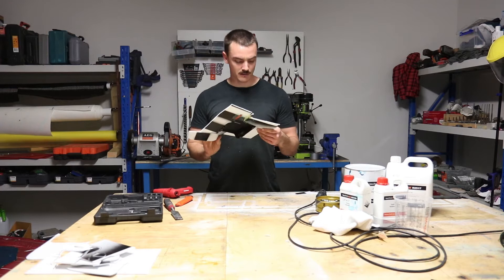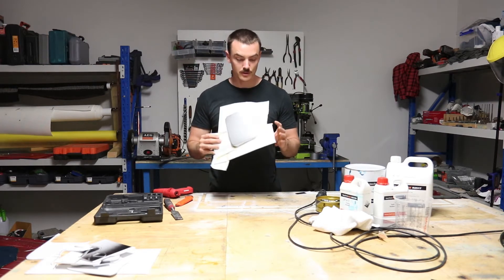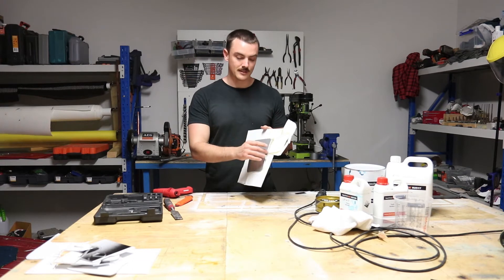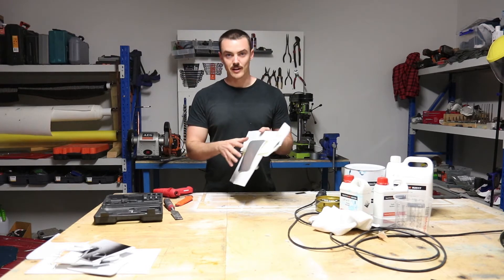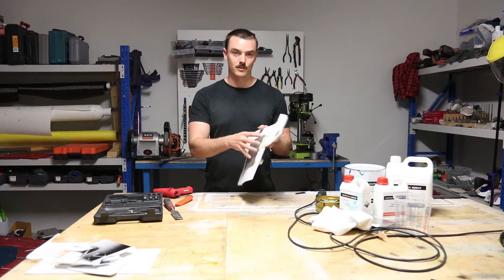Now I've made an extremely rough flange. I think next time I do it, I'm going to hire a two-year-old because a two-year-old could probably do a better job, but it will function. The plan is to put a whole bunch of plasticine around the edge to create a positive draft angle so the tool doesn't stick or mechanically lock to the part.